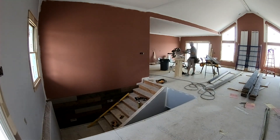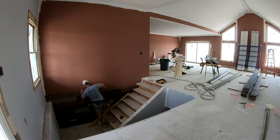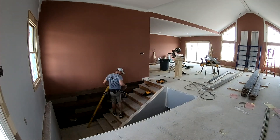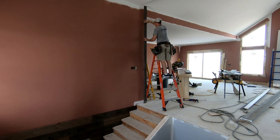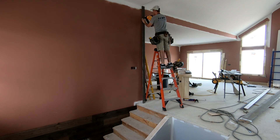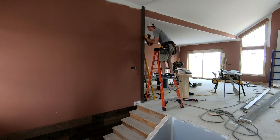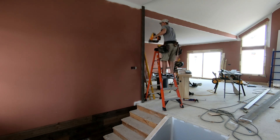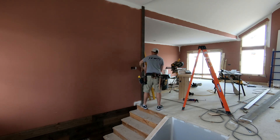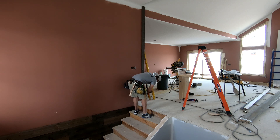After getting through the lower portion of the wall I had to decide what trim piece to use to terminate the barn wood on this outside corner. My millwork supplier sent along some one-by-four that's just a little bit thicker than the barn wood — the barn wood was about eleven-sixteenths and the trim board is three-quarters. The pine one-by-fours they sent out are incredibly twisty, curvy, and wonky; out of four pieces only one was halfway decent. I start at the top using two-and-a-half-inch 15-gauge nails to pin it tight to my framing, then push and pull the one-by-four to get it even with the outside of the corner bead.